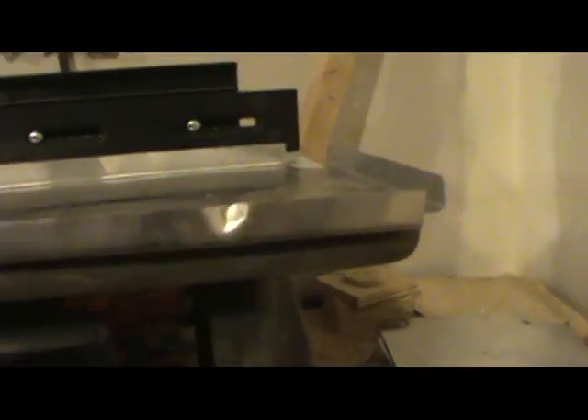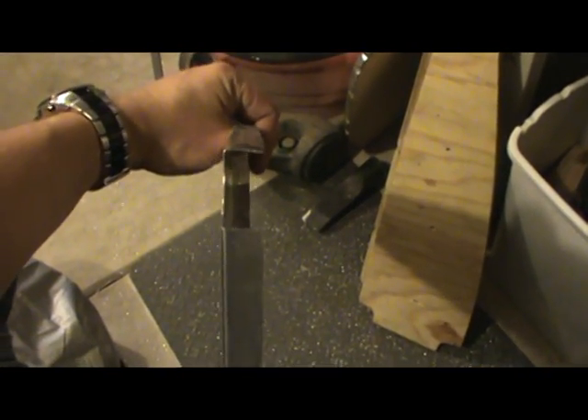Now we're laying quite flat — there's a slight amount of curvature between the crimping locations and that's just normal, that's how the metal wants to fold itself. If you can get it to lay flat you're pretty much golden. My rib lays flat across everything. I still have to cut the lightning holes out of the center — there are three in all but two of the ribs. Once I put the flanges in the lightning holes the rib will bow again and I'll have to relieve that bow out again, so don't get too obsessed with making it flat before cutting and flanging. Overall it turned out very well — very flat, very straight, no twist. We do that a total of 12 times, then flange them and do it again. Thanks for watching — good luck with your airplane builds and projects.